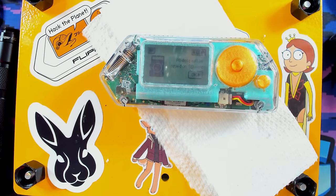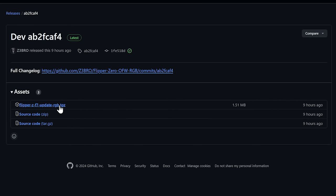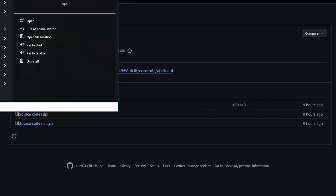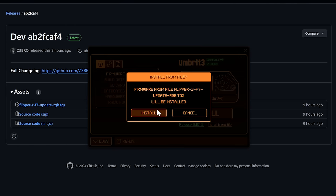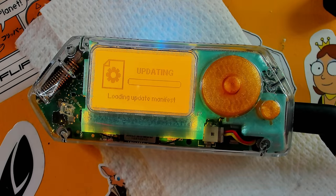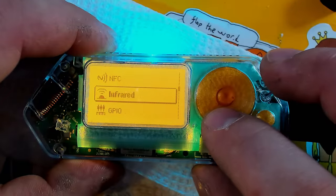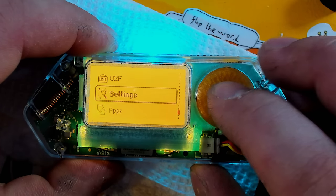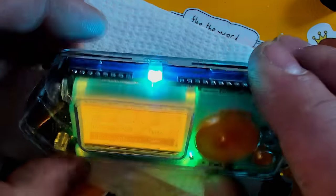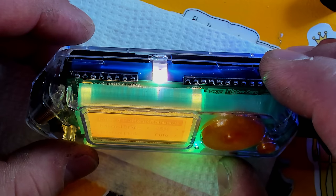Here is Zebro's GitHub repository for the firmware. Go down to the release and download it. Open QFlipper, go to install from file, install the file just downloaded, and click install. Give it a second. The backlight's working already — good sign. Firmware update success. Go into settings and we can enable it. RGB settings — turn the brightness up.